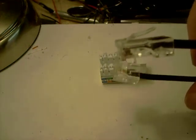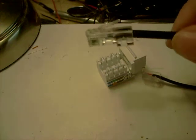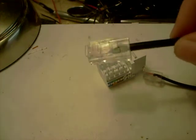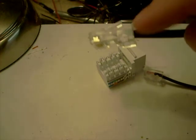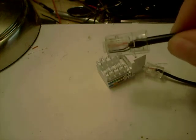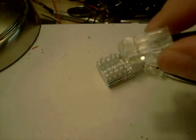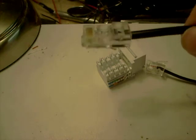And we just found that we couldn't put a wire that was thick enough in there, especially since we use a wire that has a nylon cord interwoven with the wire itself to help with strain relief. And it also allowed us to fill the sections with glue around the wire, so once the entire socket had been put together, it allows us to fill it up there to prevent wires from breaking loose inside and being yanked out should you happen to catch a branch or something along those lines. So it seemed to be a much easier solution.